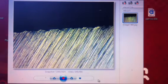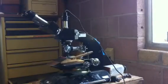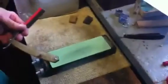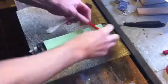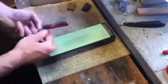Which it does with almost any bevel setting stone, we're going to remove that. And I've developed a technique for using your razor, which is really hard steel. I'm beginning by setting the bevel with a Shapton 2000 grit stone. This is aggressive enough where it really does hone your razor quite nicely. So I'm just going to continue setting this bevel.